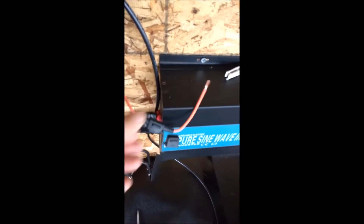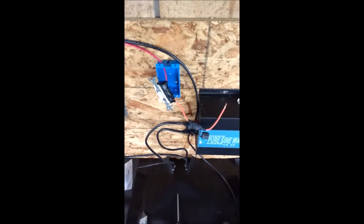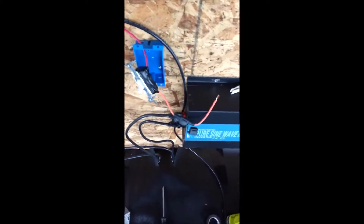I'm running the cable and in the process of wiring up a fuse and a switch that will go directly to the batteries. The fuse is going to be a 20 amp fuse because the output of the generator is about 12 to 13 amps. This is a 20 amp switch, and I've got 20 amp fuses for the mini fuse holder. I'll tie the negative cable directly into the negative lead from the 24 volt battery pack.